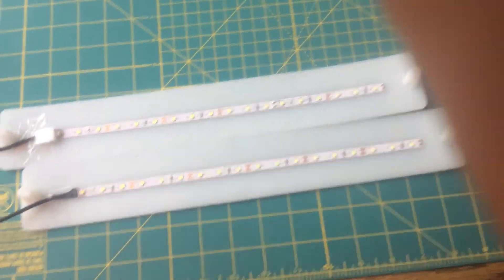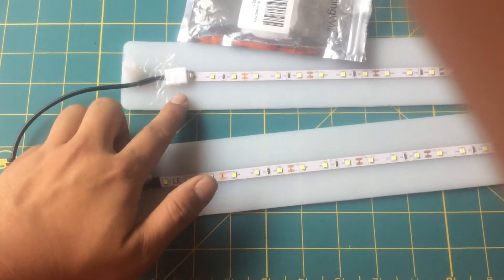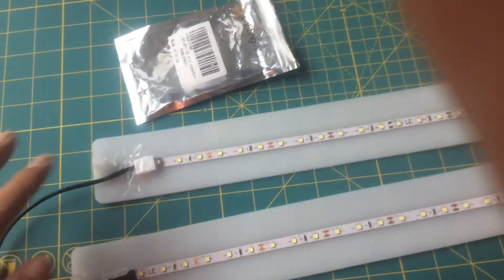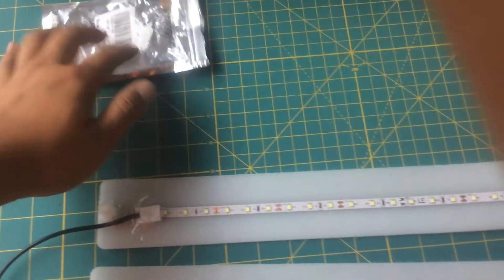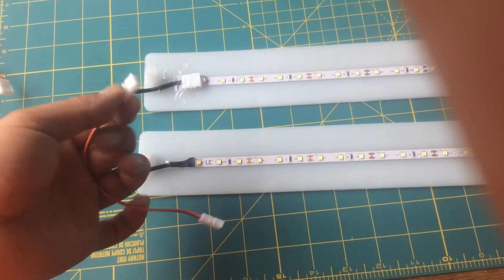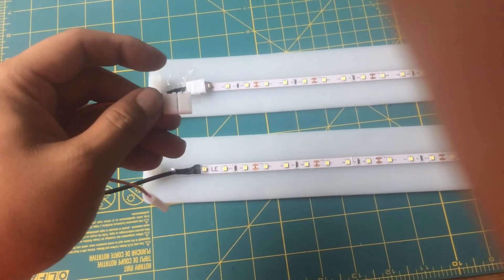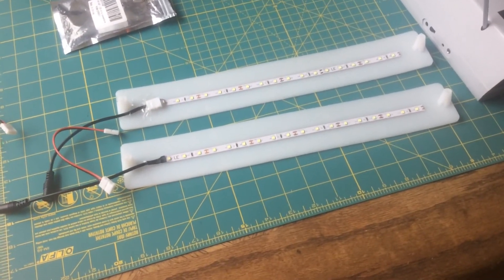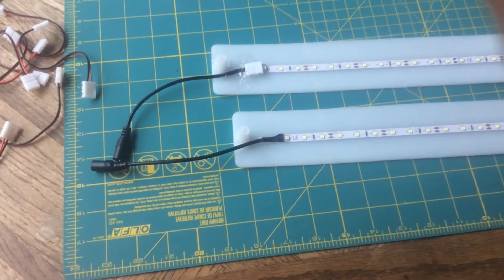Some tips: if you don't want to do any electrical work, I would advise getting one of these — specifically the power supply with the white adapter. If you don't want to spend money on that, I recommend getting some wire, probably 20 to 22 gauge, and setting this up yourself. It's really simple — you just need a pair of wire strippers and some wire, and you stick it in here. This bit pops up so you can snap it in and connect it. You'd have to make a long wire to span the chronograph, but it should be simple, and then you can use only one power supply. If you go the other route — what I have here — then you do need two 12-volt power supplies to run this.